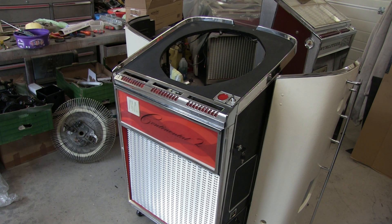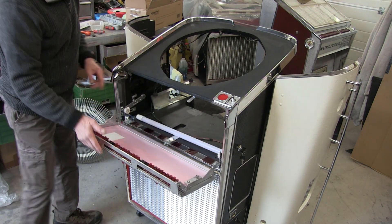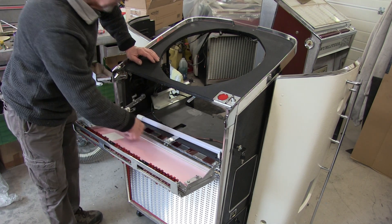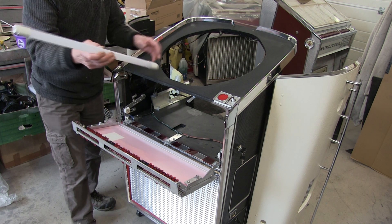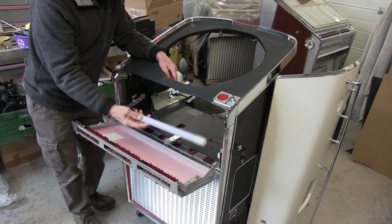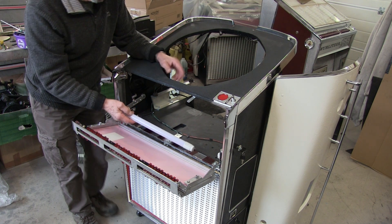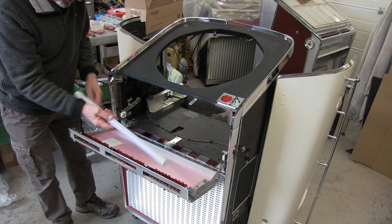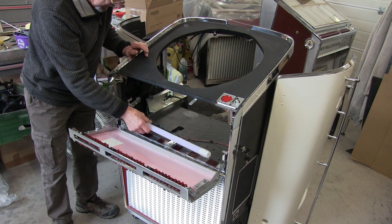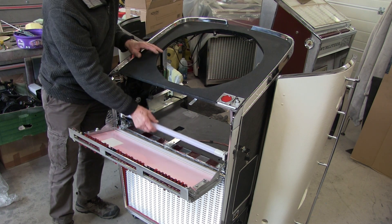It's starting to look a bit better now. Instead of putting a two-foot tube down there with a starter and a ballast, I'm using a plastic LED. They cost a couple of quid. No wires at that side at all - just two wires straight to mains at the other side, click them in there, that's that. Done. No ballast buzzing and humming.